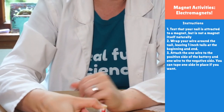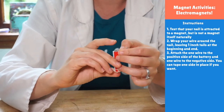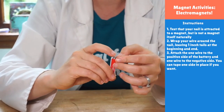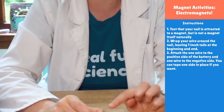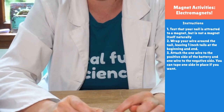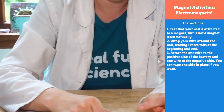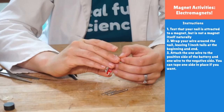And that's part of the reason why mine is also not a super great magnet. You can see it a little bit, but it's not a lot. And the ways that I could increase this is I could add a whole bunch more loops, or I could add a stronger battery. Rohan is asking about scraping the insulated wire.